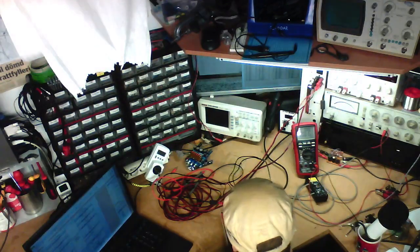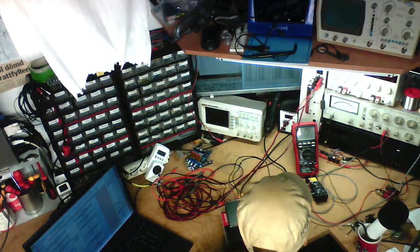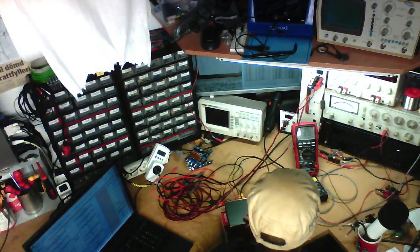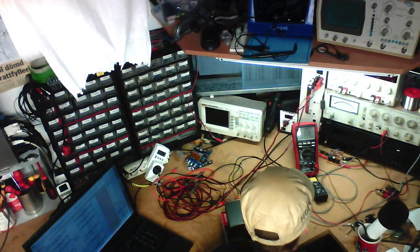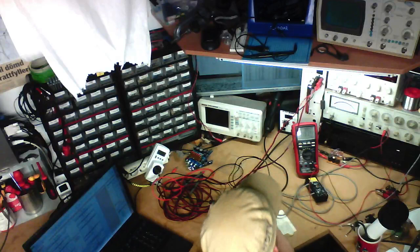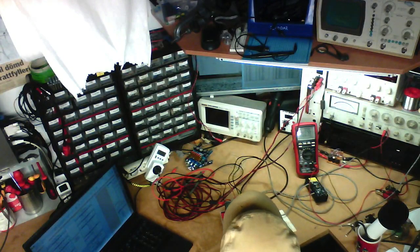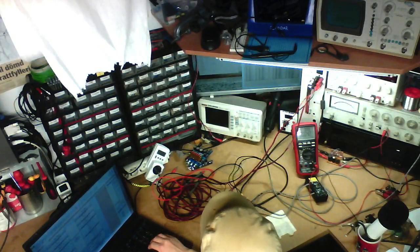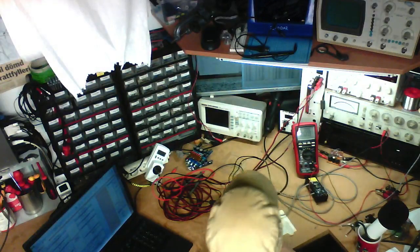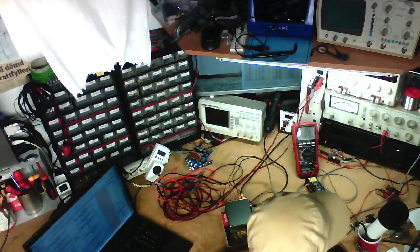Right channel, Breeze Audio TPA 3116 mini power amplifier, 4 ohms. And we've got, yeah, the right channel is performing a lot better at 4 ohms, a lot better. We've got 11.92 volts. That's going to be like twice the power. Yep, 35.52 watts. So the left channel gives you 18 watts, the right channel gives you 35 watts. There you go, Chinese quality.